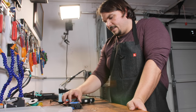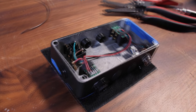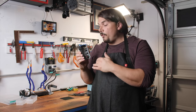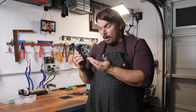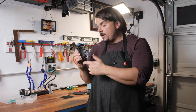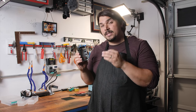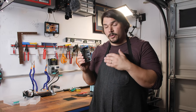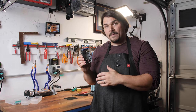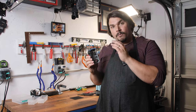So we can see we have our DC wired in — we have two DC leads going into the jack because we're paralleling those up. We have an input buffer and an output buffer. You can expand out multiple buffers if you need to add an additional output buffer. You could parallel those up the same way no matter how many buffers you use. These buffers only draw about 15 milliamps of current per buffer, and they run anywhere from 9 to 36 volts. So you can have almost any voltage going into this to power up these buffers — the more voltage you use, the more headroom they're going to have.